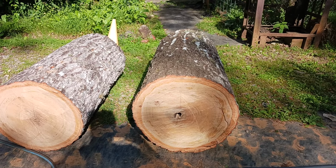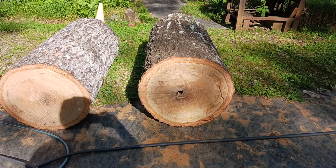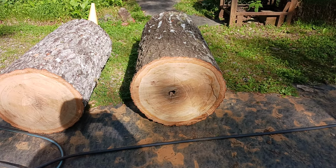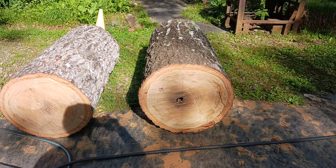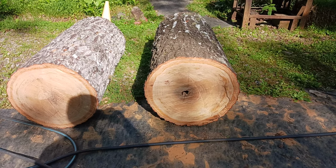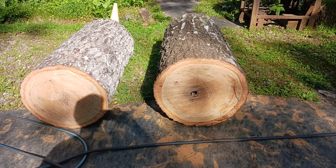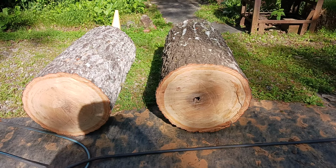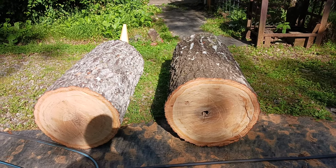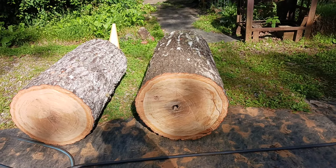And that last tree I had that I've been splitting up, I don't think I've told you anything about it. Oh yeah, I told you I got a tree and I was making stuff out of the sapwood of it, because it had that ring shake or something in it. Had a weak spot in the tree. I didn't get any slats out of it. I believe I ended up with 7 sets of back posts and all the rungs and front posts and airfoils and frame fronts and everything for those chairs. I had the number 7, and they were actually the last ones I bent. They failed on the inside. I had sapwood plus heartwood. And the heartwood side of them, at least one of them anyways, the heartwood just crushed. So I only got 7 instead of 8. But that's all right. It was just free wood.